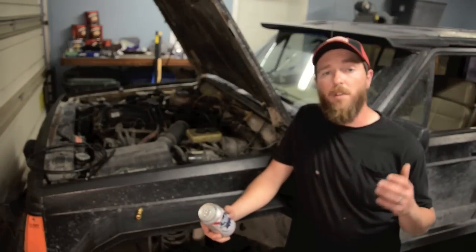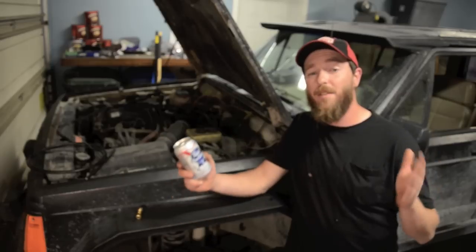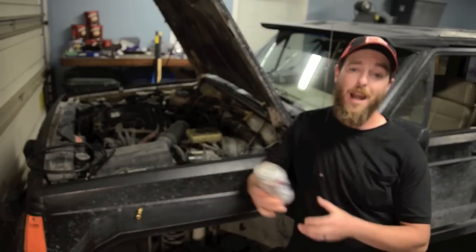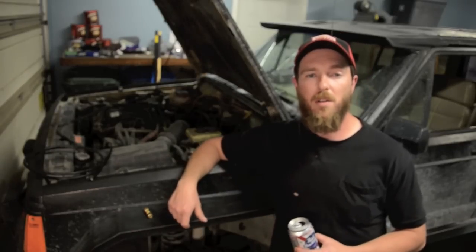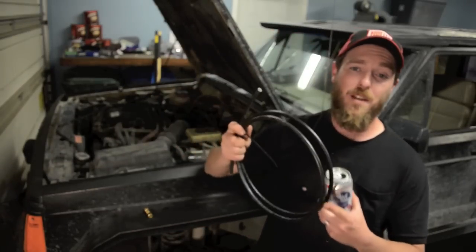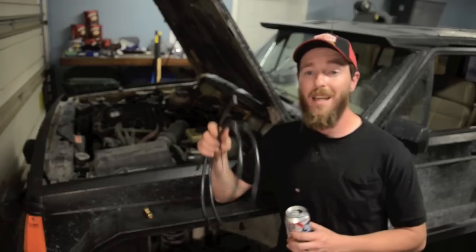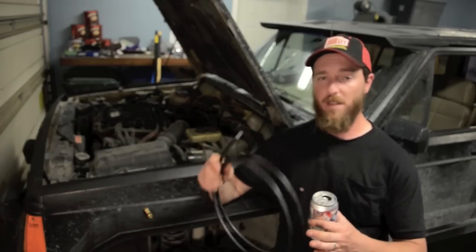Last time I showed you how to convert your AC compressor to use it as an air pump. Now I'll show you how to deliver that compressed air to your tools and the components that you'll need. A lot of people are iffy about using plastic air lines, but this 3/8's hose is the same stuff they use for semi truck air brakes. It's simple to route where you want it to go, and the best part is it's easy to splice if you're in a jam.